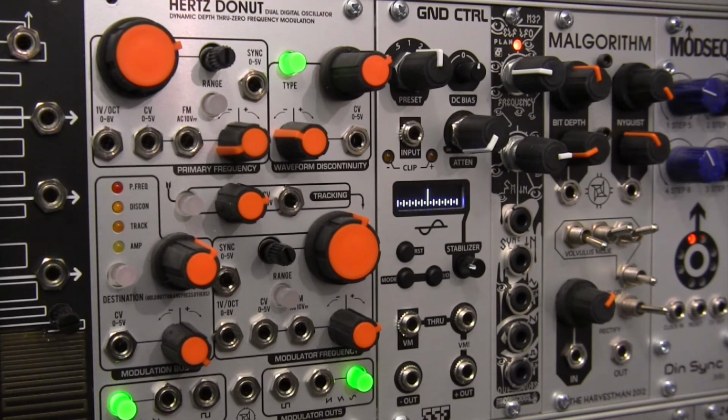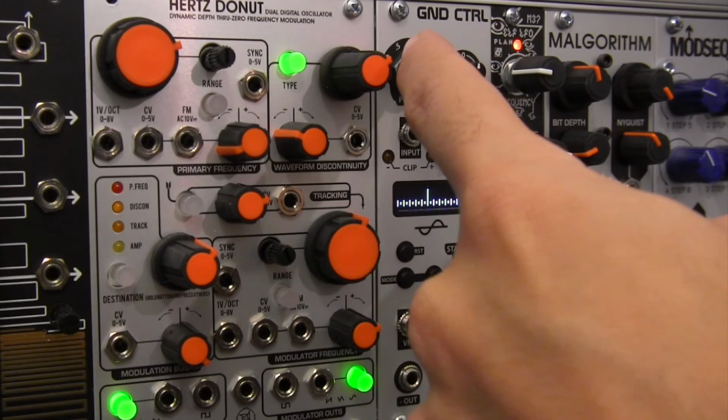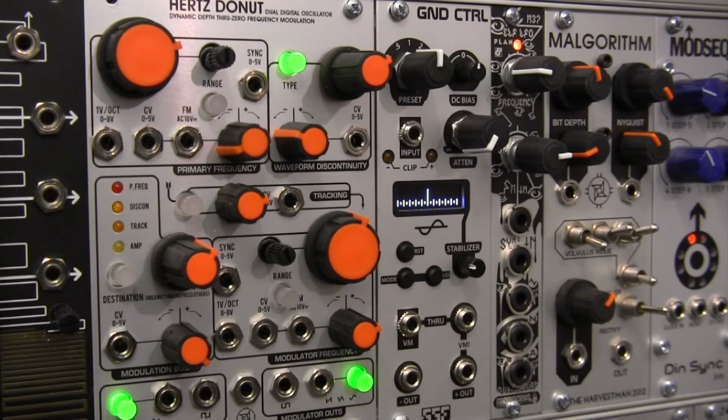Next up, attenuation. On your preset control, you have 7 commonly used ratios dialed in. 0.1 and 0.2 can primarily be used for video synthesis and Eurorack conversions. The other 5 settings will be used for CV scaling and/or for boosting external signals.